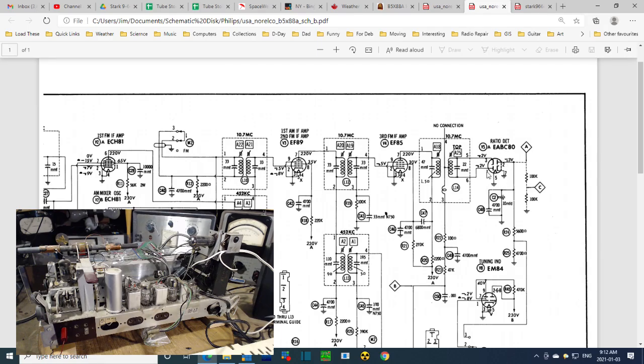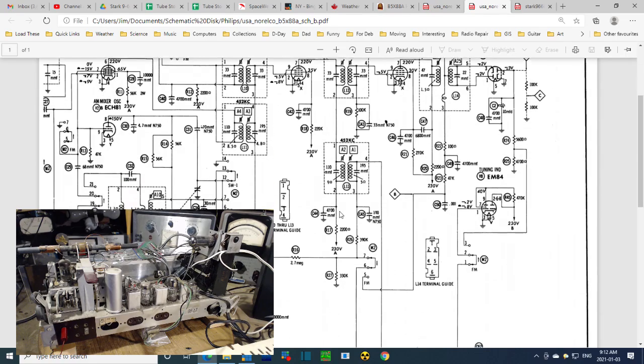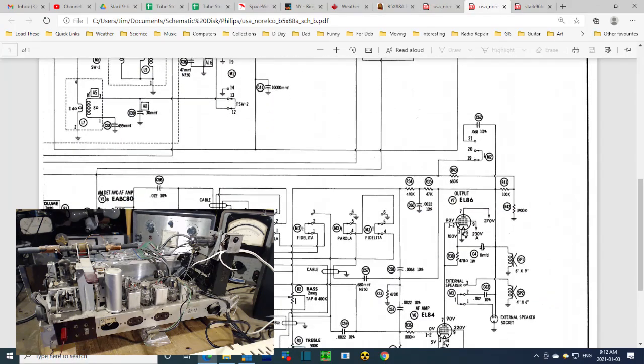There are double diodes there to run the FM detector, and then there'll be one more diode with a triode thrown in here for some reason. Another diode down here to detect. Oh, triode generating AVC voltage maybe? Or the triode doing what it always does, just boosting the audio signal after detection and passing it on. That's what it's doing.